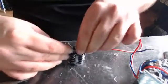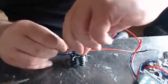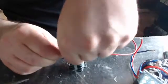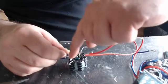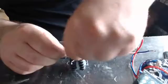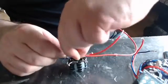So, last wire, center. I'm going to twist it like 4 to 5 times this time. Make sure the caps are discharged when you do this, because if the wires touch, it's going to spark and the wire is going to become hot. You're going to burn yourself. Well, these are new, so they have no energy in them at all. But if you short out the wire and your finger is there, it's going to burn you.